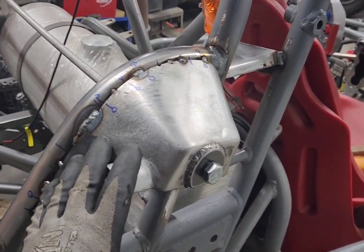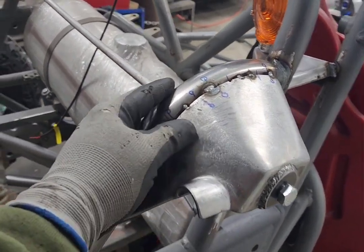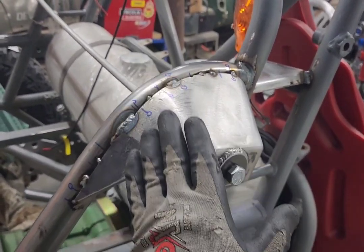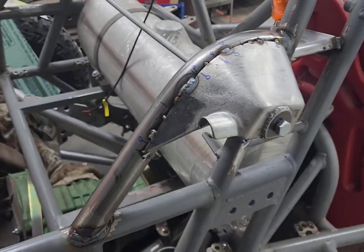That's all the welding I'm going to do on these for mock-up. What I'm going to do now is brace these tubes, because the force will be coming straight up on this but it can also tend to push in. So I'm going to brace somewhere down in the chassis and triangulate all this. That's what I'm starting next.